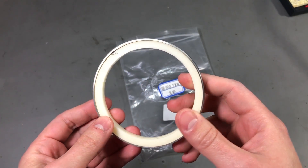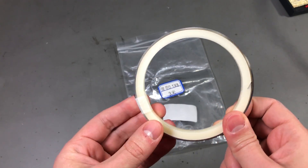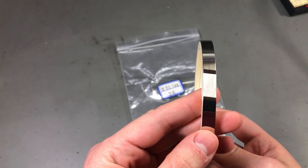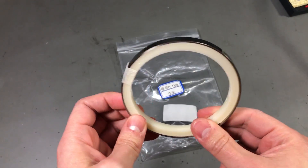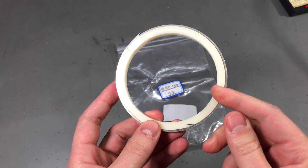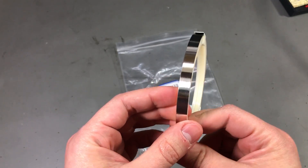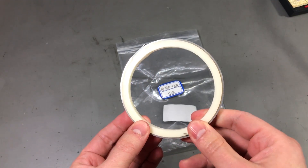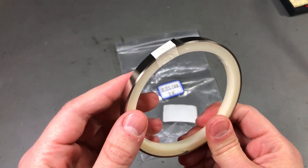My next item is a roll of pure nickel strip. This is used for creating connections inside battery packs with a spot welder — if you haven't seen my DIY spot welder build video, I'll link it on screen. This is 8 millimeters wide by 0.1 millimeters thick. The reason you want this to be pure nickel is because of the lower resistance, which is a desirable parameter when building battery packs that could potentially supply very high currents. This one came nicely packed on a plastic support, and I think it wasn't the cheapest option on AliExpress, which inspires a bit of confidence that this might actually be pure nickel.